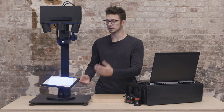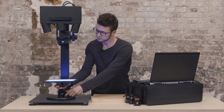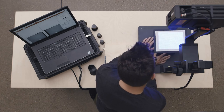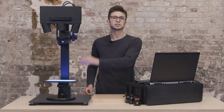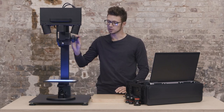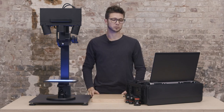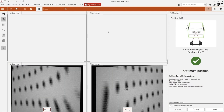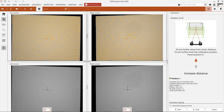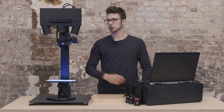I will start by putting the plate in the correct position now. I move the sensor to the desk stand, so it's very easy to play with the height. The two laser points help me to determine the center of the measuring volume. When the correct position is reached, the software tells me 'optimum position' and I can take my first scan. I can follow all the instructions and take all the positions needed to calibrate the measuring volume.